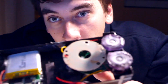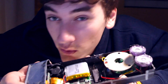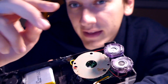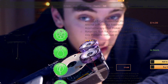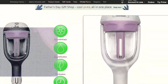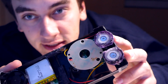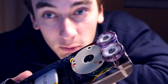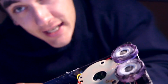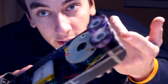What we're going to do is create a thin stream of fog to project onto. This fog screen is produced by these two ultrasonic vaporizers — I ripped these out of some car humidifiers, they're super cheap, like 10 bucks. It works by vibrating these metal plates at a very high frequency, specifically one that causes water droplets to explode off of them. It produces a perfect stream of vapor that we can project onto using only water.